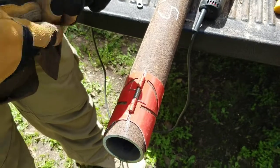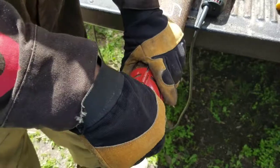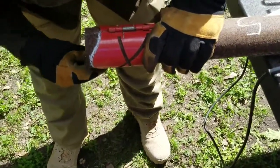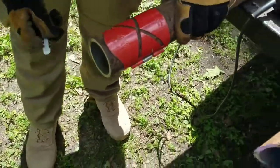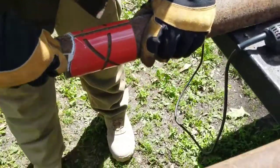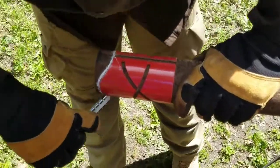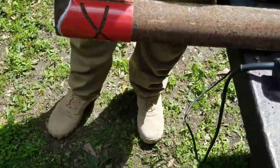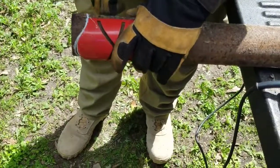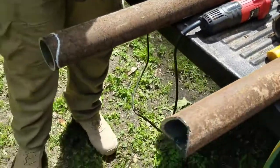And then with a soapstone, come in and scratch it into that groove, working my way all the way around. And then to get that template off of there the easy way, use your pin wrench for your grinder and just put it in there and pry them out. That will keep you from tearing up your other tools or hurting your fingers.